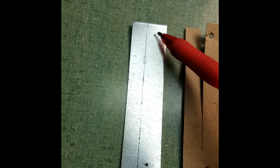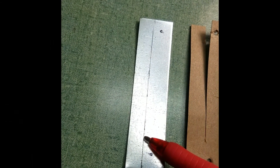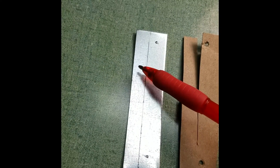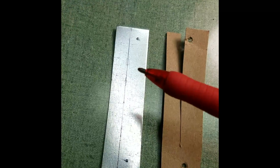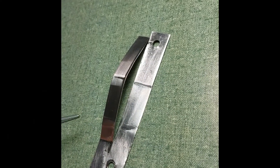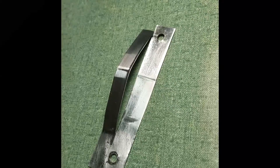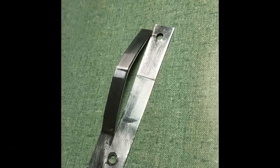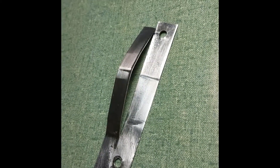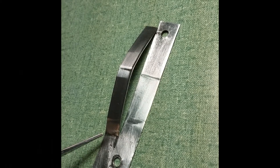We will have to drill this hole out, and then cut down here until around here. After that, you'll have to bend this piece so that it touches the back of the hub, and fiddle around with it for a bit in order for it to work. For the holes, I would suggest using a smaller pilot drill bit, and then use a Dremel tool to enlarge the hole. Otherwise, you may end up with crease marks, because this is a thin sheet of metal and it's very easy to bend.